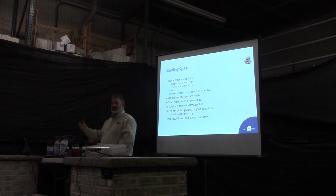It makes a lot more sense, and now with the added stresses on the cooling system because of all the pollution control stuff on your engines, they're doing a lot more work keeping the engines cool. You have cooled EGR, you've got turbocharger pressures that are boosted up, which raises the amount of temperature in the engine. It all combines, so it's better to keep everything up to snuff.